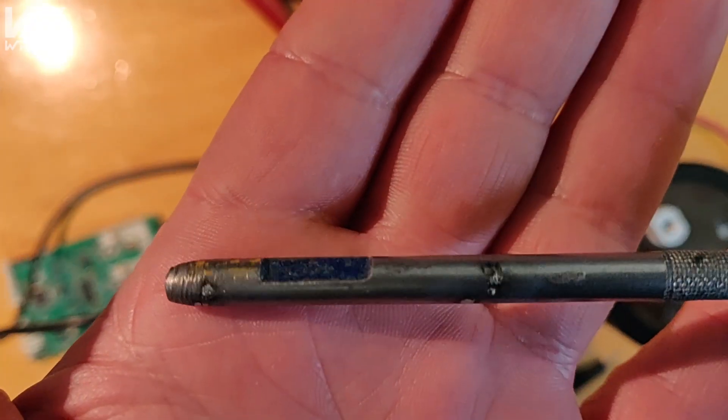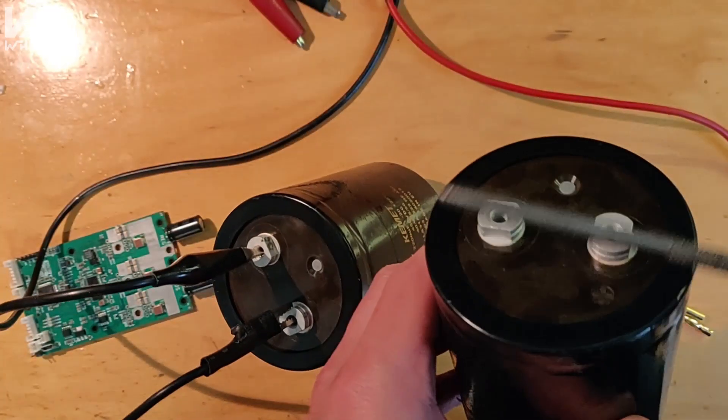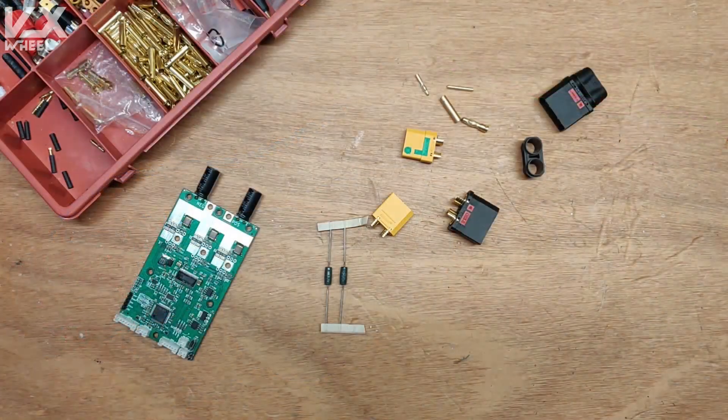You can clearly see the damage on the connector, and on this piece of metal that I used to bridge the capacitors. When you're doing this over and over again you slowly get a very bad connector with very high resistance, and that's getting worse each time. Okay, so now that we know that sparks are bad and the anti-spark is pretty much needed, we can talk about our options.